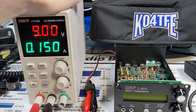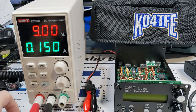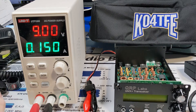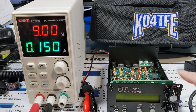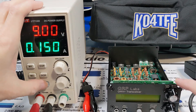So what that does is if there's a short or some other problem in this board and it tries to draw too much current, it will shut it off real quick. The instructions say this should have exactly zero current draw when you first power it up. However, I've heard that the new ones actually have firmware installed, so it is possible for this to have a little bit of current draw. But we'll just see — I'm going to hold my breath and hit this button.